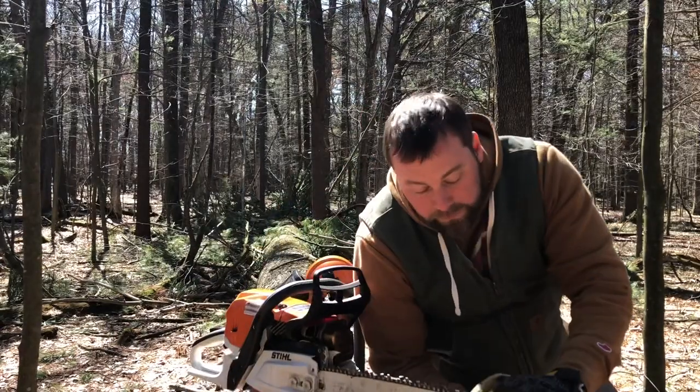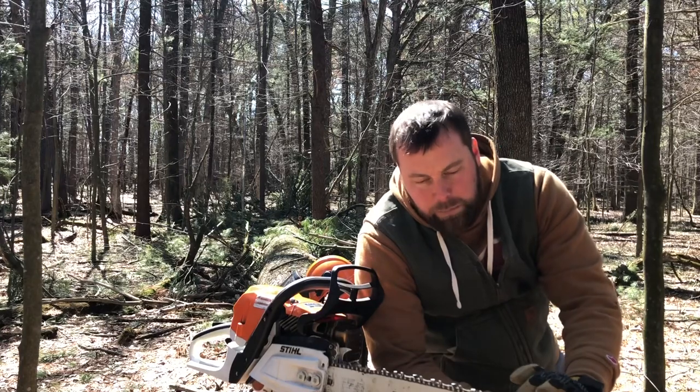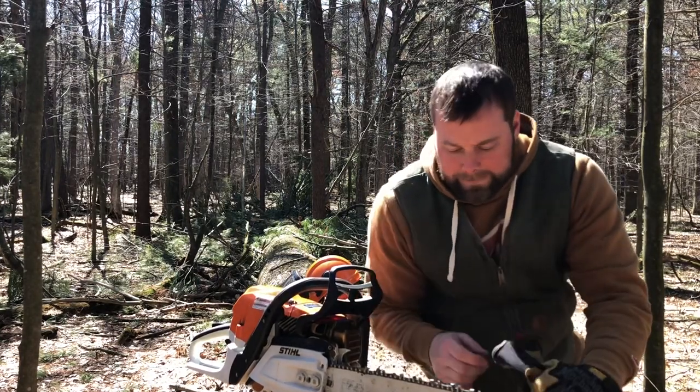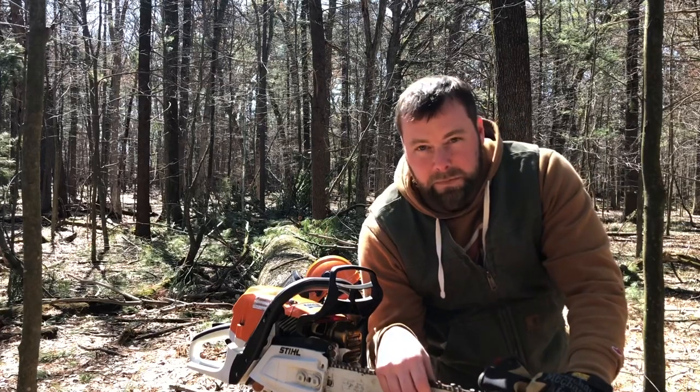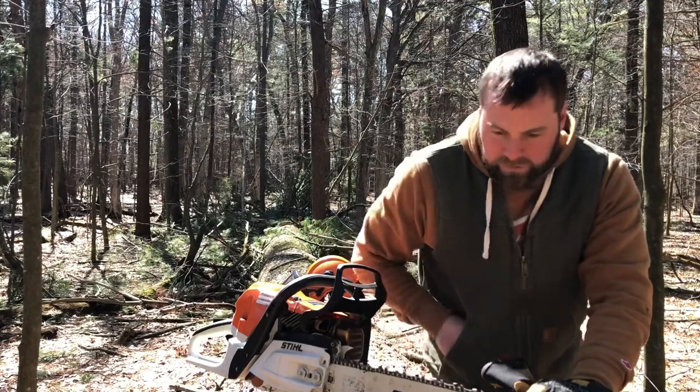So one thing I did learn from him was that you should go slow with your drill bit and push on it. And I was going the fastest my drill would run. And that actually just heats up the metal and hardens it even more. So, and then obviously use a good drill bit.